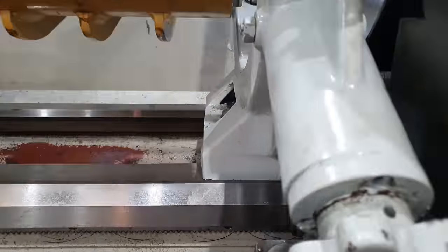So I've put the dial gauge on a few of the different surfaces inside. We are getting a lot of run out. What I'm going to do now, I'm going to throw another dial gauge in there so I can have one of them on the back surface and one on a front surface to see if the run out is concentric and it is even or if it is offset of each other.